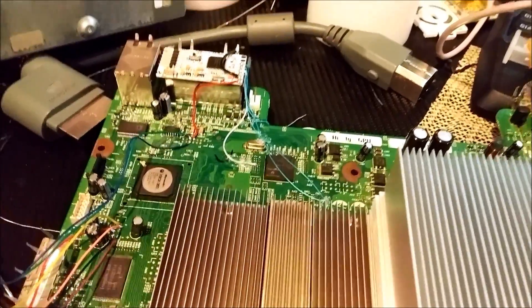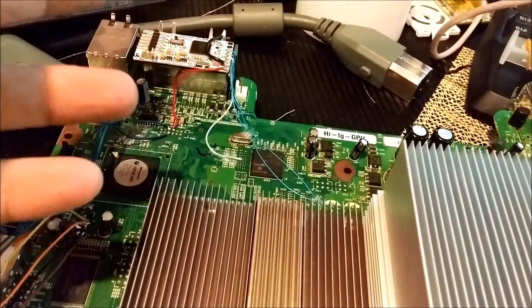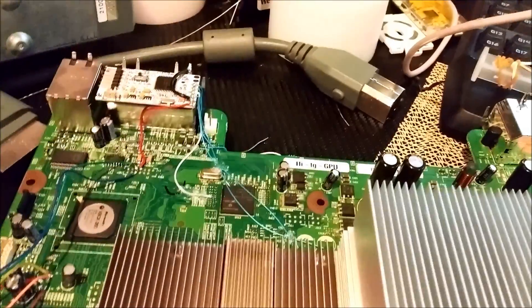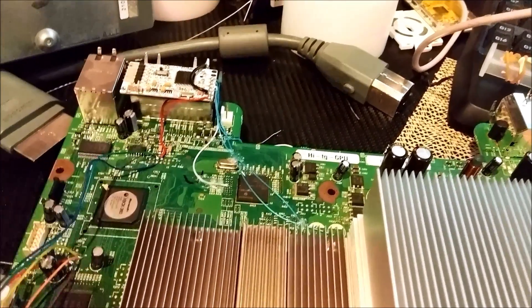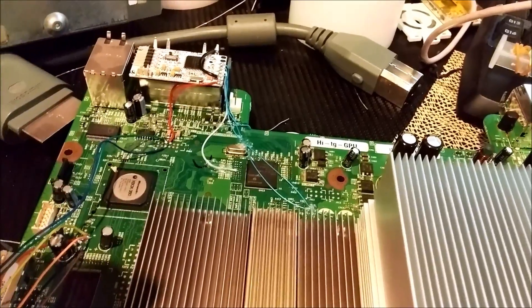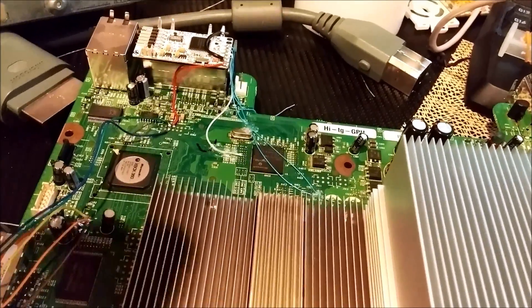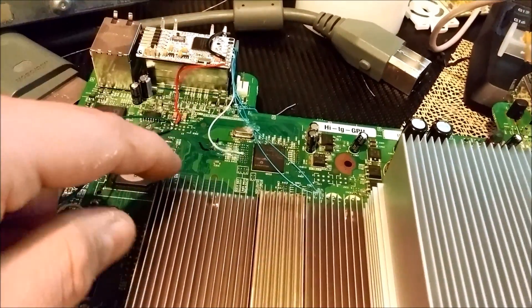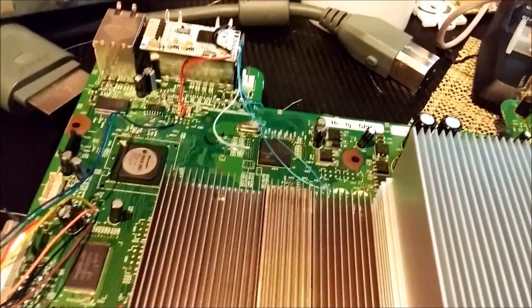Back to the top side of the board, you can see where those two come out — right underneath the heat sinks — and they run direct over to the chip. There's where CPU RST comes out and runs direct over to the chip. I've done two consoles this way — one with a Rev-C, one with a CR3 Lite — both on Falcons, with phenomenal results just like what you're seeing. User 15432, the Mad Russian over at TeamX360.co.uk, deserves all the credit. There's a section dedicated to RGH 1.2 over there. Go check it out.